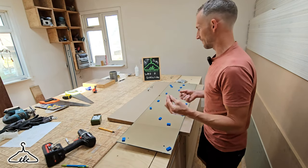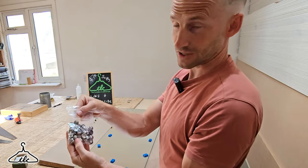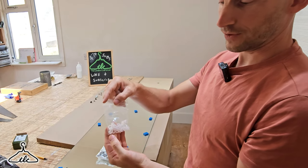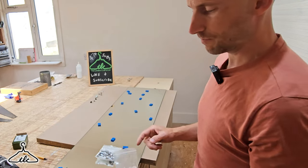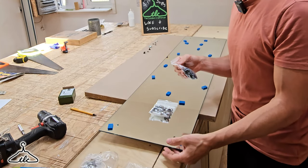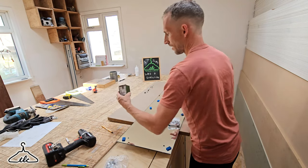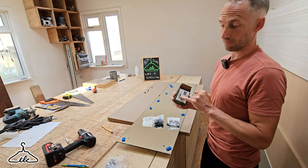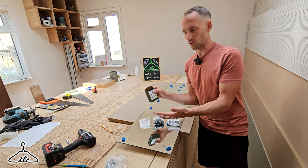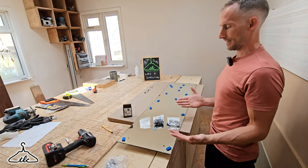We'll go over costs right at the end because there is a two-thirds saving. Let's look at what I have in my pack. I have got dome heads — they just clip on. I have got little plastic caps, so the screw will go through that and protect the mirror, and it will also allow the cap to clip on. And then we have washers. The washer is going to go behind the mirror and protect it so the mirror is not squashing up against the door or the wall. We've got three components there. We also need screws — I generally use a 20mm screw for an 18mm door, so 4x20s. The length of the screw also depends on the thickness of your door.